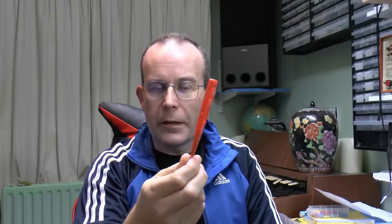So that's what's inside one of these red testing pen type things with the liquid crystal display. And very cheap. Do they work? Well, not really. I mean, they do obviously work if you jam the thing in the socket, but then you're relying on those resistors inside, and bearing in mind those are only surface mount jobs, who knows how well they're going to fare with mains voltage shoved across them. And of course the other bit, though it kind of did sort of work when it could be bothered, certainly not a reliable method of indication.